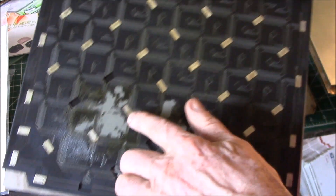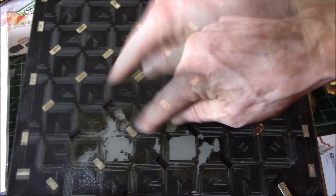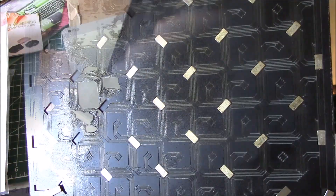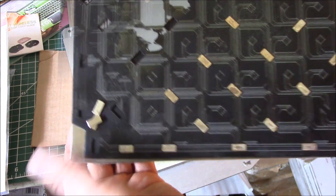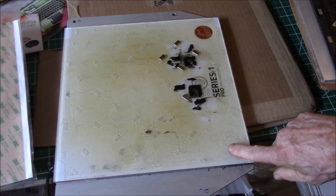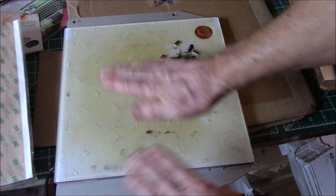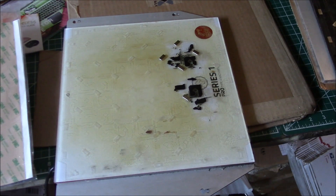The quarter-inch sheet of aluminum is going to go on top of the glass, and then you're going to clean the magnetic base off and glue it onto the aluminum. If you leave the steel plate on the back side, the magnets will all stick into the holes. All these circuit board traces are supposedly decorative — when I talked to Build Tack they said that doesn't really do anything, just makes it look pretty. Be careful because the magnets are a little bit brittle.